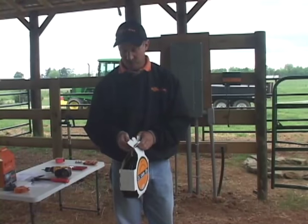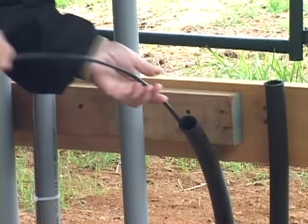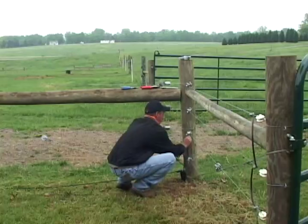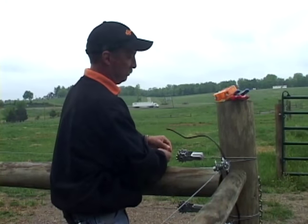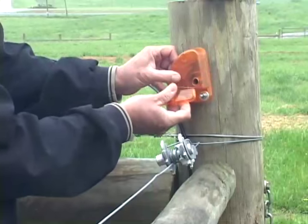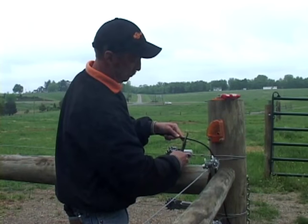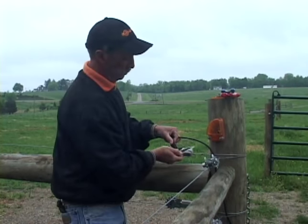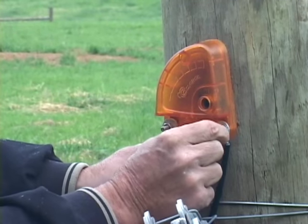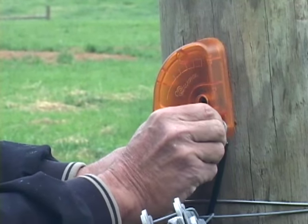Using double insulated cable, plan the path your wire will take to reach the connection point on the fence. Today we are using conduit. At the appropriate exit point, run the wire from the energizer through the conduit — if there is a wall, you may need to drill a hole to allow the wire to pass through to the connection point on the fence. You will want to install a lightning diverter. Take your lightning diverter, remove the mounting screws from the back, place it on the post, remove the face plate, and drill the screws into the post to mount it. Using wire strippers, cut and strip a 2 to 3 inch segment of insulation. Unscrew the nut and remove one of the washers. Place the bent exposed piece of wire around the connection point, place the washer back on, and tighten the nut down. You have just installed your lightning diverter.